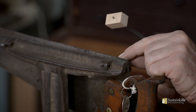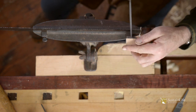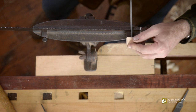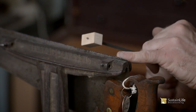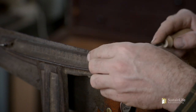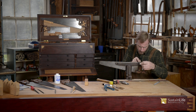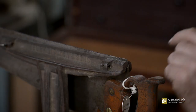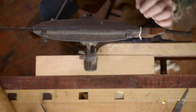I'm working across these teeth, shaping as I go. This one has no flat on top but a little flat on one side, so I take gentle pressure on that side — just light pressure. For the next one I'm putting more forward pressure because there's more flat on one side. You can clearly see which teeth I've filed because filing removes that steel blue layout fluid we put on there.